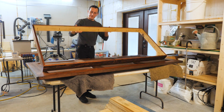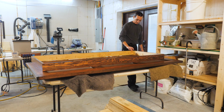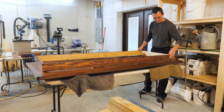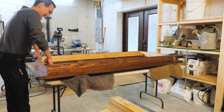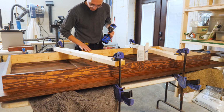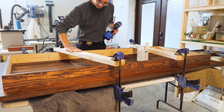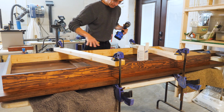Okay, here's the apron we glued together a while back. The miters turned out really nice. This is the one we did the reinforced strapping tape on. Gosh, that is dead on exact. And so I have the apron sitting just on top of the tabletop here, and it is clamped down with these boards because it is perfectly set, it's perfectly square.